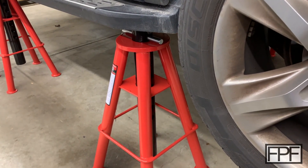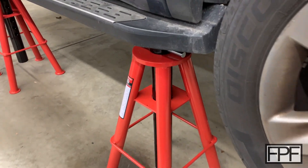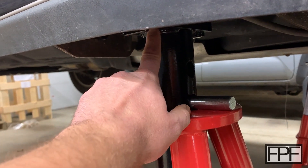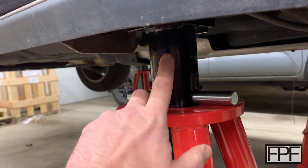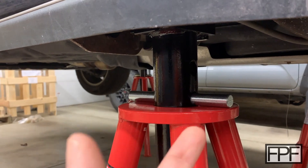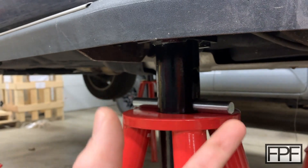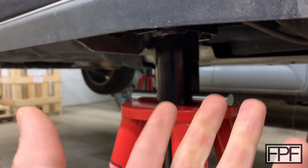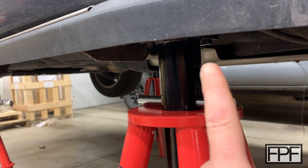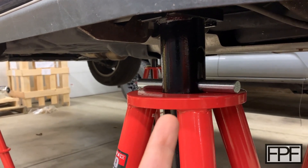When I got them, I realized that giant jack stands like this are not designed for normal cars. They have huge metal pads at the top — really designed for something like a semi-truck with a large frame. So I had to make some adapters to basically support the car on top of this. Otherwise, that pad was just going to hit the underside of the car, and the part you want to support — the pinch weld — wasn't even going to rest on the pad. It would basically destroy the rocker panel and undercarriage cover before the weight of the car even got onto the jack stand.